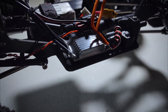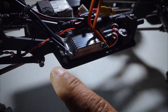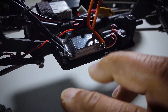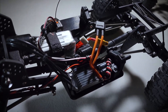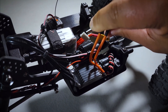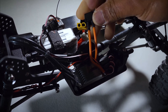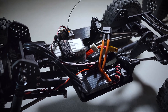Now when you get one, it's not going to look like this. I cut the shrink wrap off and de-soldered the factory wiring — that's something I always do because I like to wire my electronics to fit. It's a direct connection to the motor, and I make my power lead to length so it just reaches the battery. That gets rid of excess wire, drops weight, and just looks cleaner.